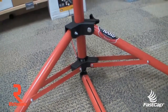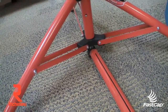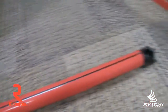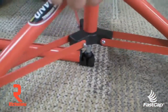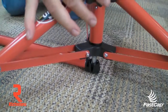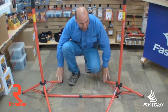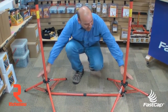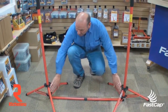You're just going to loosen your tension knob, and now you're going to make your ball detent snap into place, just like that, and now you're done. Then re-tighten it. Do the same thing over on this side — it's very fast, very easy. Loosen your knob, snap it into place, then re-tension this. So as you can see, you have both your tripod legs going out like this so you can walk through easily, and then this leg should be extended straight out. Then we can put the dust door on here.